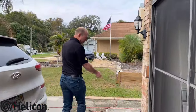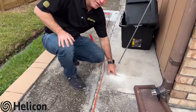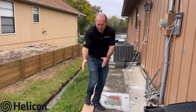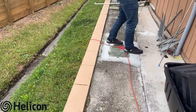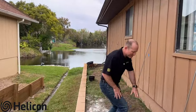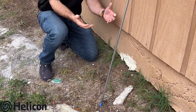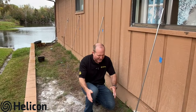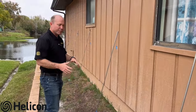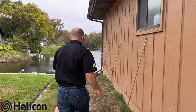We'll have points on the perimeters and in areas where we have concrete — they drill these points in to insert the rods. We're also protecting this stem wall or retaining wall by adding stability to the home's foundation. Here's a little bit of an area where they were getting some erosion, so once we install all of our chemical grout, they'll come back in and probably bring in some fill dirt, possibly put down some grass, to put this home's foundation back on solid ground and protect it from erosion.